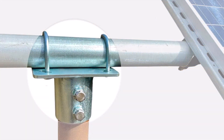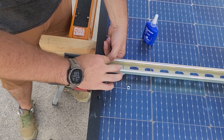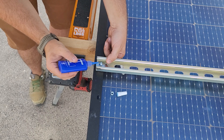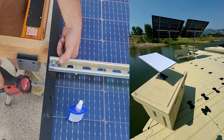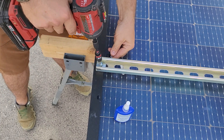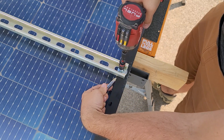This top cap is also supplied by places such as Iron Ridge — I bought mine on Amazon. It has an adjustable angle but only works well for one solar panel in how I'm setting it up. To make sure it doesn't come loose I'm using both a crush washer and blue Loctite. Red Loctite would be more permanent, but I wanted the option to undo this in the future, so I stuck with blue Loctite. The simplest thing is to use the closed end of a wrench to hold the bolt head while you tighten the nut.